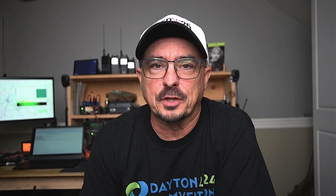In the Meshtastic software, I only needed to make a couple of changes. I did change my Bluetooth pin code — when you get it, it's going to be 123456 if I remember right — and I changed that to something that only I would recognize. I left it in client mode, which is the way it comes out of the box. Since this is not a high level node, I didn't use repeater or relay. Client should be sufficient. And then I changed all of the smaller nodes like my Trekker Delta to client mute.